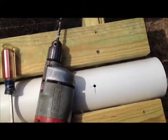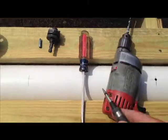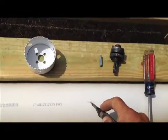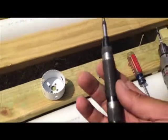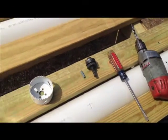I drilled my first hole. It's off just by a little tiny bit because the size of the bit is so large. So I'm going to use this metalworking tool — it's a center punch, it's spring-loaded, and it just pops a little indentation into it for the bit to find. You don't need all these fancy tools; I just use them because I have them. A little bit off on your hole isn't going to make a huge amount of difference, but I'm just kind of detail-oriented when it comes to that.